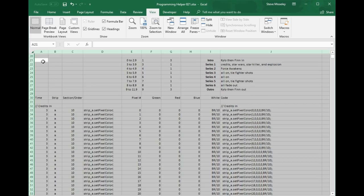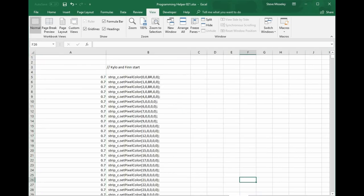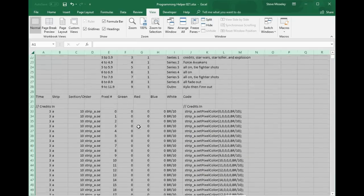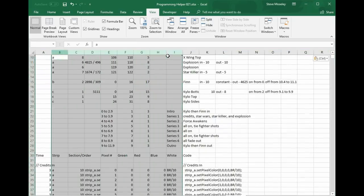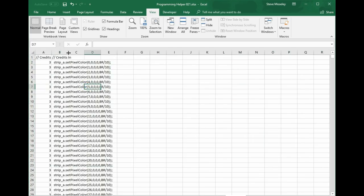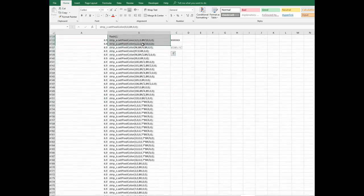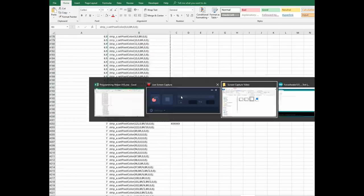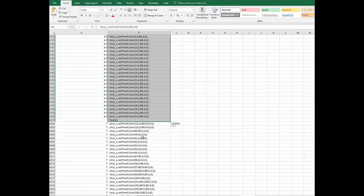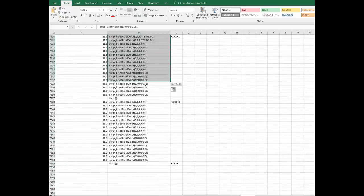The columns represented the green, red, blue, and white portions of the LED. I basically ended up creating a storyboard for the animation effects. I decided what would happen for each LED for every section of the storyline, then I assigned a time frame for when that pixel or LED would be updated. Once I had all of these created, I put them all into one spreadsheet and sorted them by the time at which those updates were to happen. I think trying to do all of this programming within the Arduino text editor would have been nearly impossible without keeping things separated in the spreadsheet.